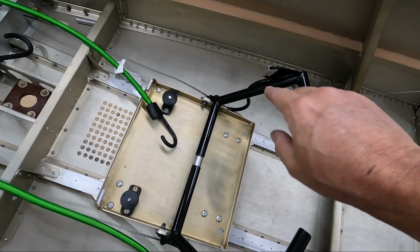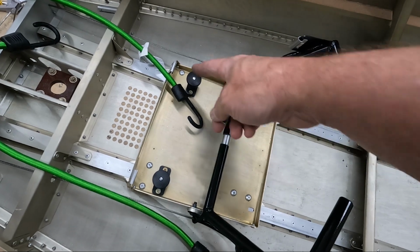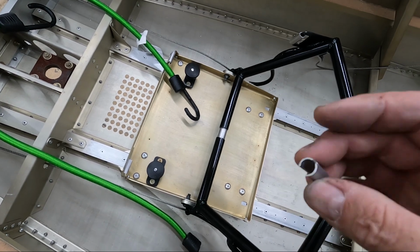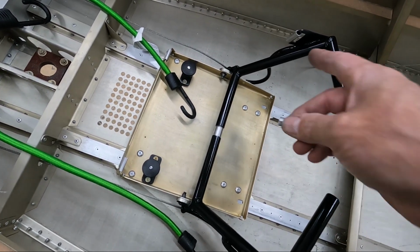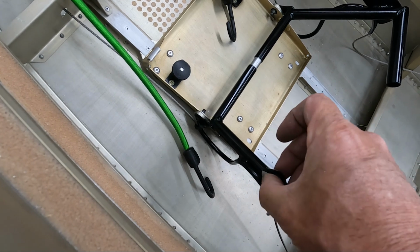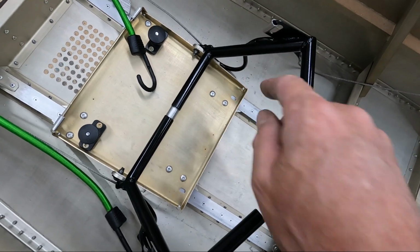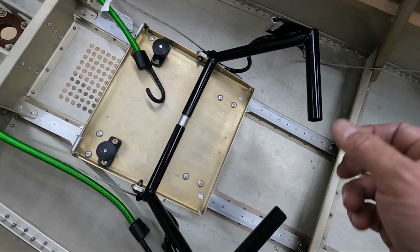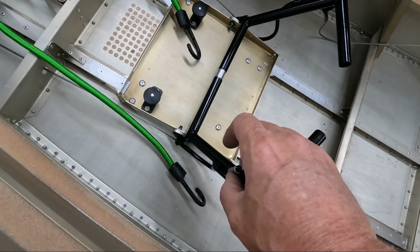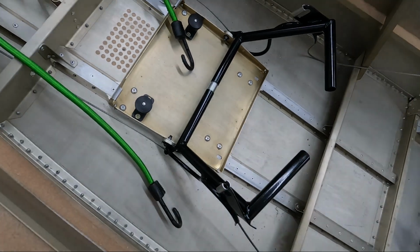So I tried to create something that would bend around the radius here on this hole, and it just didn't work. So I'm doing the same thing I did on the bottom here, where I just took a tube like this, and on my mill I cut this slot into it, and cut a small slot in the other side so that it would fit down further on here. Basically this just slides in like this, and then I can crimp it on there. It's not going to really protect down in the very bottom of this hole, but I'm not sure there's going to be a whole lot of tension on that part of it. I'm going to have to test it out and see, but I'm just going to clamp this one on here, and we'll try to put the bungee cords on next and see how they fit.